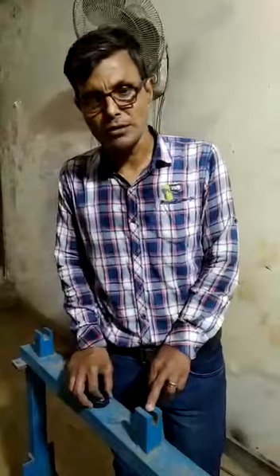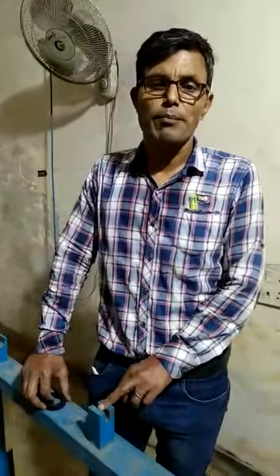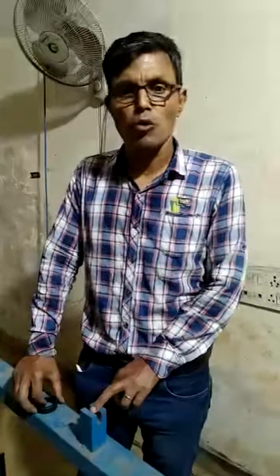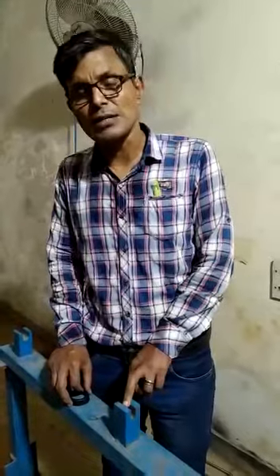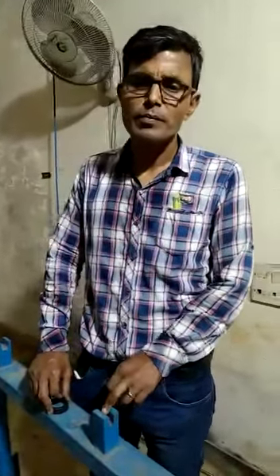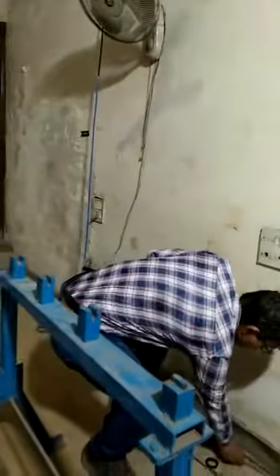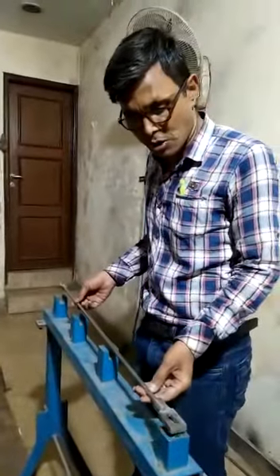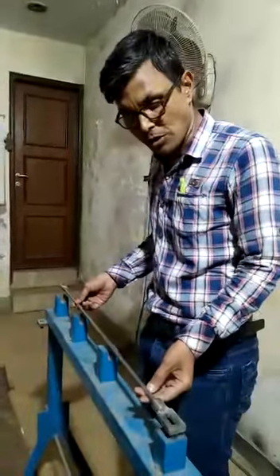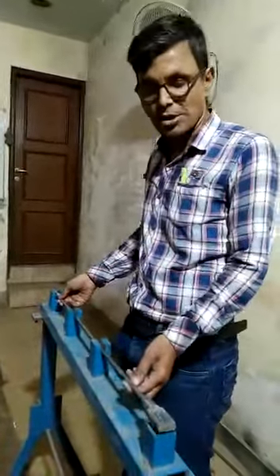The second point is the assembly point. The straightness and alignment of pump rod, pipes, plunger rod, and bore, etc. should be checked by the manufacturer as well as by the technician in the field before installation. Now I will show you the plunger rod. The plunger rod is checked by gauge to determine whether it is straight or not. This plunger rod is straight and it is okay.